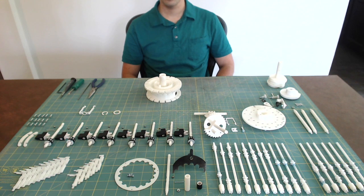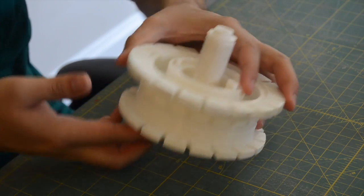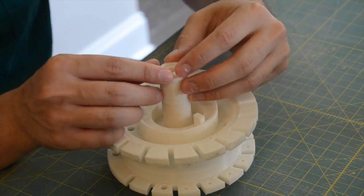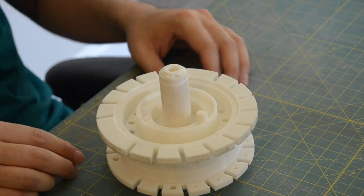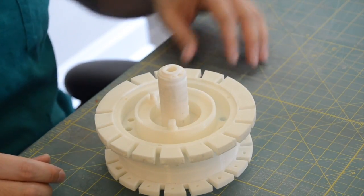Assembly begins by fastening the tens bell spring to the tens bell. I forgot that step and started by putting the tens bell into the main casting. After that, a washer is added, then a C-clip is added on top of that to hold the tens bell in place. The two parts should spin freely. Lubricate with PTFE dry lubricant as necessary.